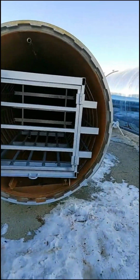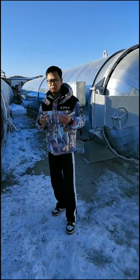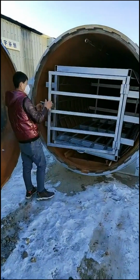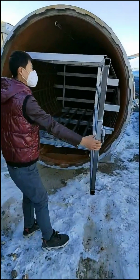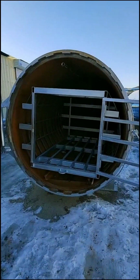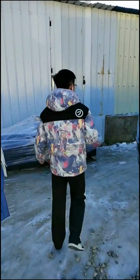What's more, besides the steaming oven, we could also provide a boiling tank, which can also boil the wood. But one problem is that the boiling tank produces some polluted water, so it is bad for the environment. This is the only difference, but it depends on customer requirements. This is the second process, and then we go on.